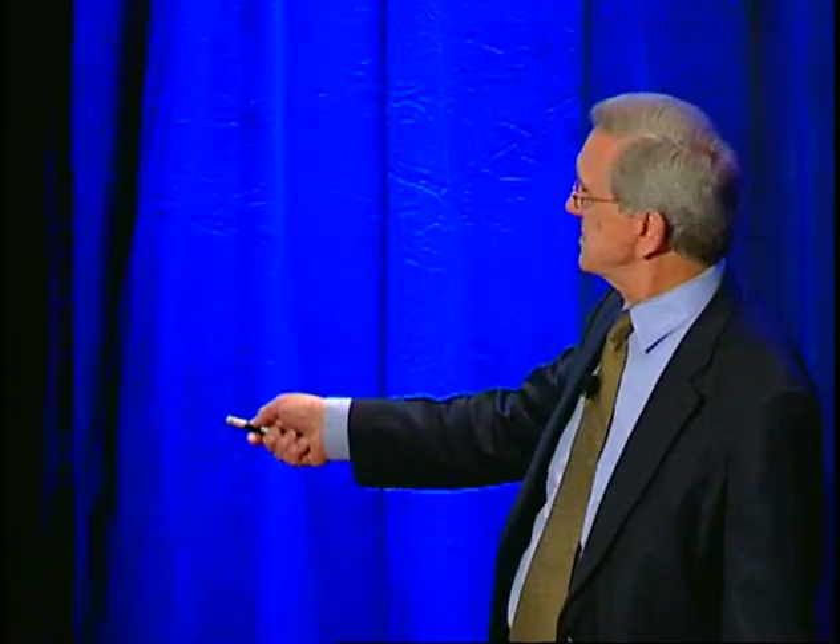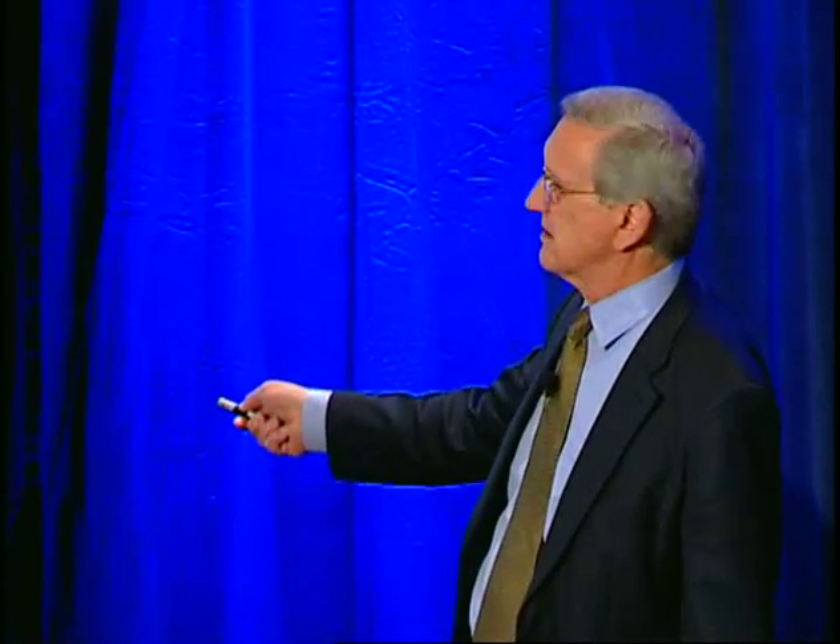When it comes to conveyor legs, don't use the aluminum frame structure legs because very often you have dead spaces there and find all kinds of material accumulated underneath. Sanitary legs are much better. A decent leg, but what I would have preferred is a tripod leg — these are catalog items today, available to buy, and you should encourage your equipment suppliers to use them. They're probably a little more expensive, but definitely worth it. The tripod leg serves the same purpose, is more open, and is easier to clean. Think cleaning — constantly think cleaning.